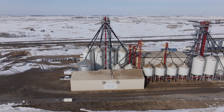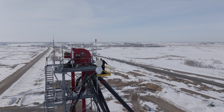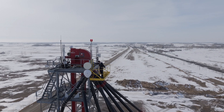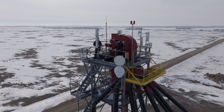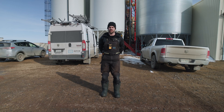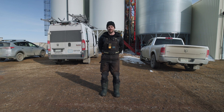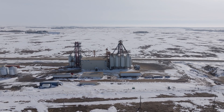We're at one of our transmitter sites today just east of Regina, and we're upgrading the backhaul connectivity to the site, increasing capacity and reliability. That'll involve installing a new antenna, running cabling to it, and linking it up to the other tower further east. We'll hang the antenna first, get it aligned and tightened down, then route the cabling from the antenna over to our switch, plug it all in, and we're done.